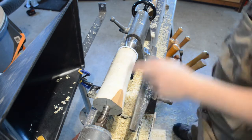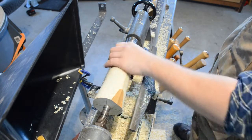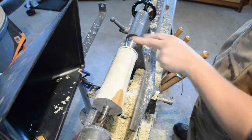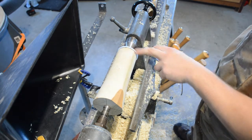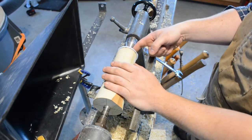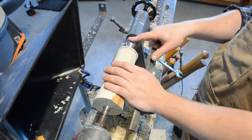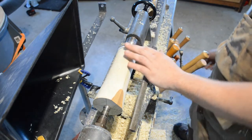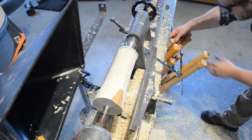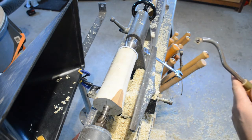So what I ended up doing was I actually couldn't get a good contact without my template moving around. So what I did was I put a screw in to hold my acrylic base plate, throat plate in, and I took my quill and I gently countersunk the screw just enough so that my quill could sit perfectly in the center without damaging the quill of my tailstock. So now what I'm going to do is I'm going to turn this, and I'm trying to use the sharpest tool I have to do that, and I'm going to pick my carbide cutter.